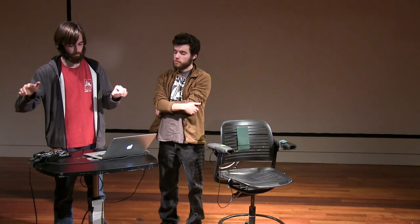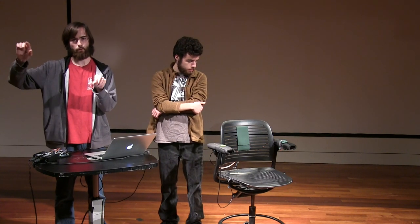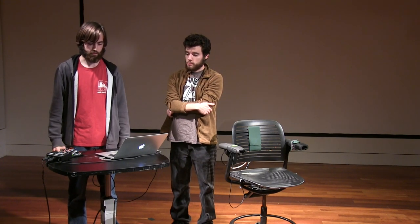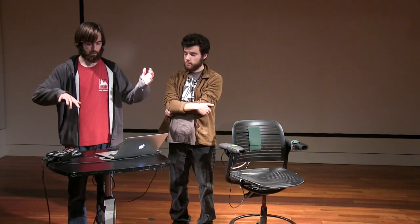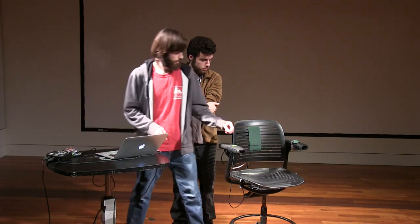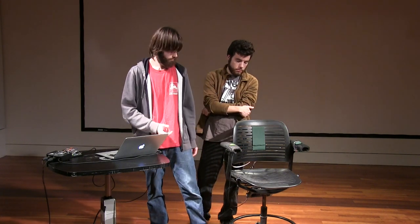And so I have that as the basic model, but then when you press the FSR, it basically takes each of those integers to the power of a number a little bit over one, so it kind of stretches out the spectrum. It creates an interesting sound effect. Yeah, and then it feeds that through FM synthesis, and the various effects basically control various aspects of the FM synthesis. And this one is a low pass filter, and the buttons control the two voices, which just control the bass frequency that we use.